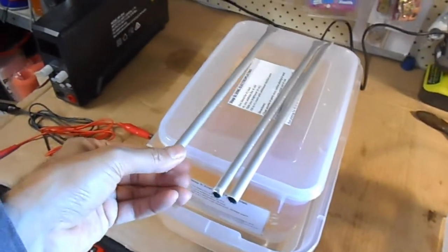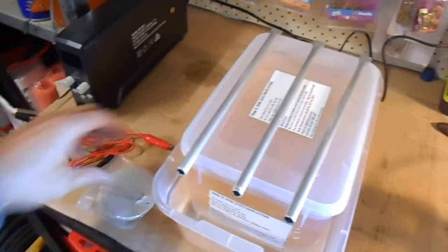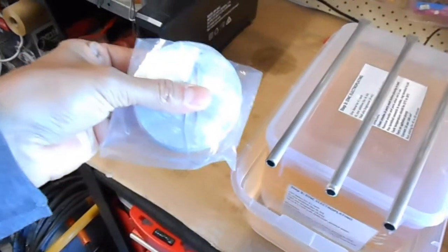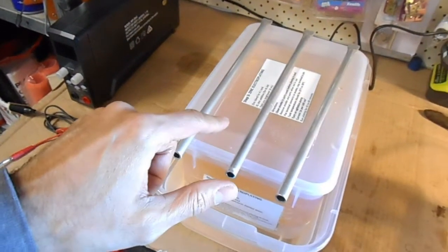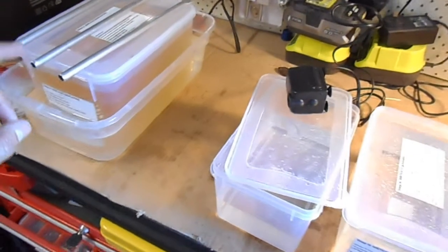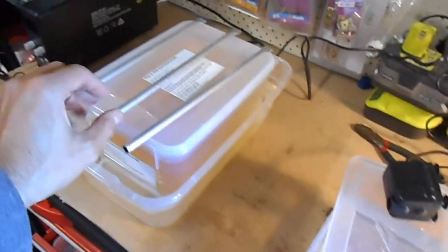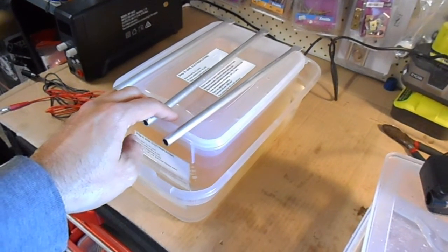I will have that set up shortly, so these rods go on top. When I get up to this stage, you'll see how it's set up. These are the zinc anodes. One of these goes on each side, and then on the centre rod, that's where we're going to hang up the job. Once the job has gone into the electroplating, it should come out nice, bright, shiny with the zinc coat.